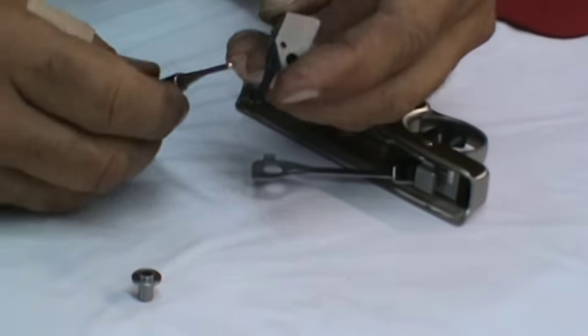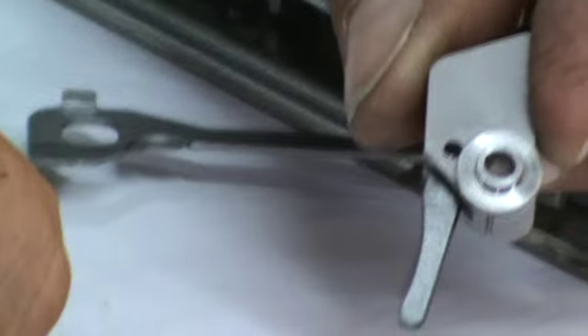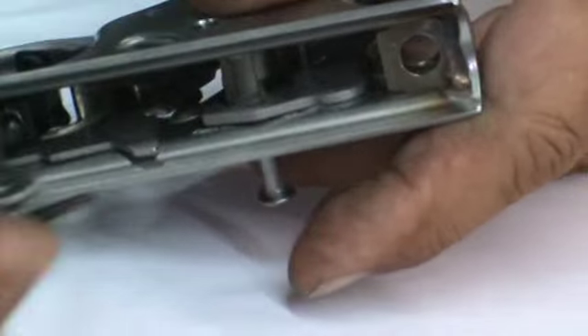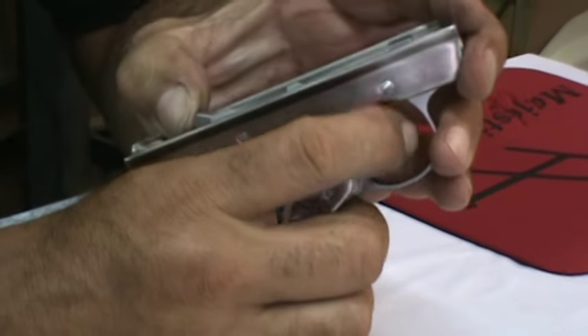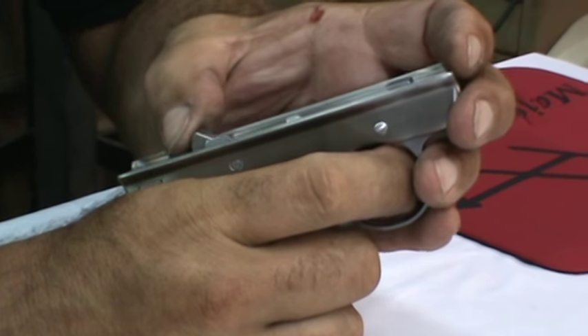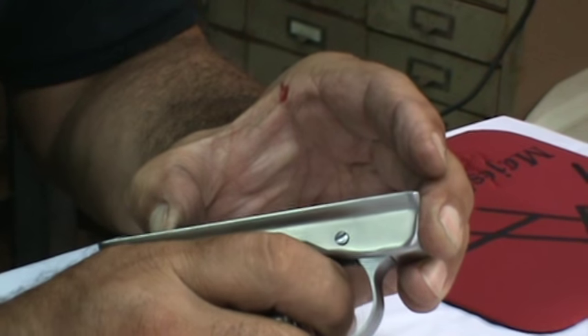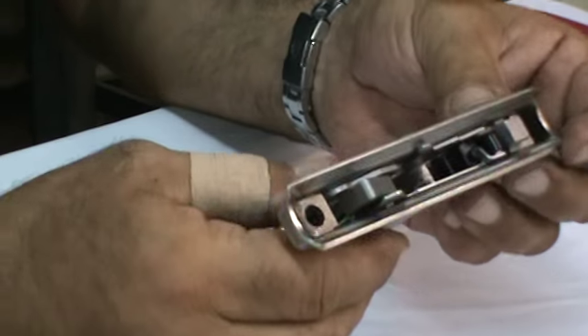The strut does have a front and a back - you'll see a radiused cutout that goes to the back of the hammer. That's how your arrangement looks. I'm going to take the bushing and put it right into the hammer. This all goes directly into your disconnector bar. I'm going to put it in and look through the frame like a window - when it lines up, put it in. Cock the hammer; I heard the sear snap into place. Pull the trigger and the hammer moves forward. Keep pressure on the back of the hammer - there's no spring on the job just yet. When I pull the trigger it doesn't move, and when I pull it again it goes. All the work on our lower frame is complete.